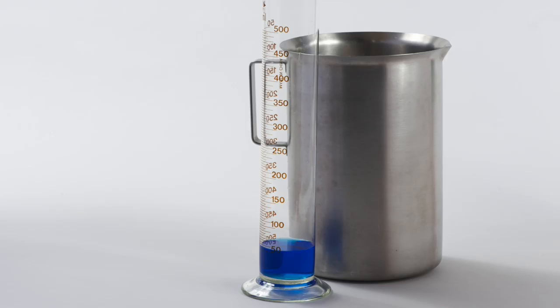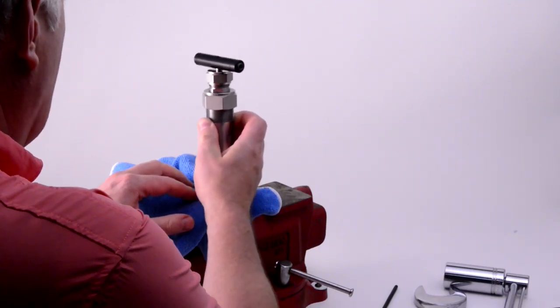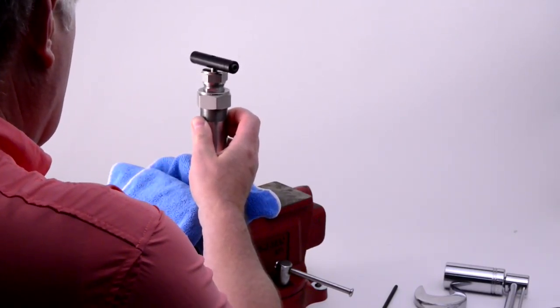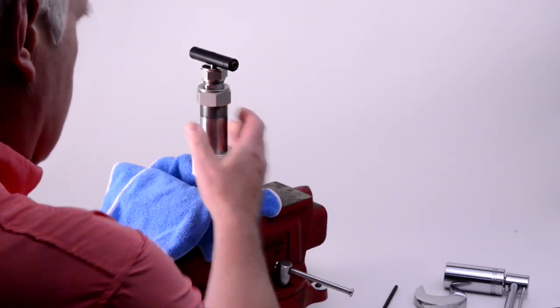In addition to the tools required for disassembly, a 1 gallon stainless steel container about 2/3 full of hot water mixed with non-sudsing dish or laundry detergent should be available to soak disassembled parts if the nozzle has been used in a foaming run. Gently snug the nozzle body in the vise, adjuster end up, using the scrap cloth in the vise to protect the nozzle surfaces.